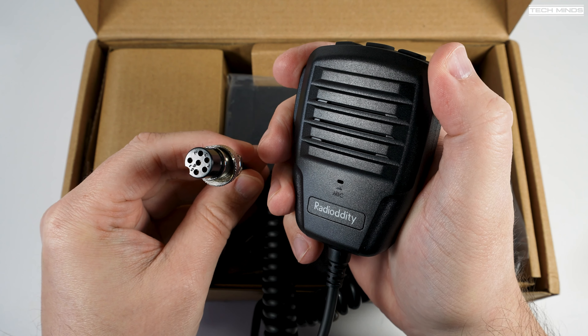As well as the channel number being shown, the frequency is also displayed on the screen in the lower left corner — something us hams much prefer over having just a channel number. There are some nice features available in this radio like automatic squelch, CTCSS, and DCS, plus noise reduction on both transmit and receive. Don't expect top-tier radio DSP quality, but the noise reduction does work to some extent and can make received audio sound better than a radio without it.